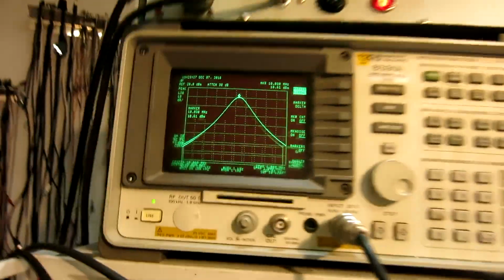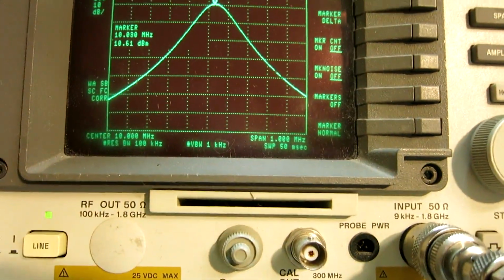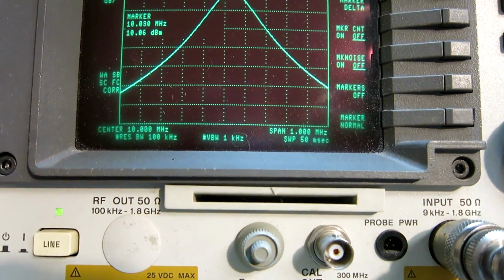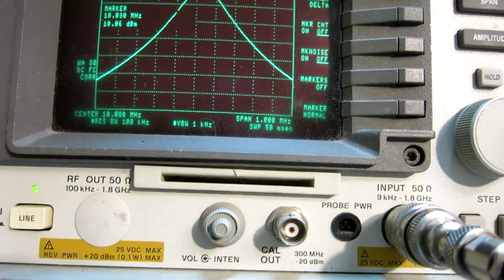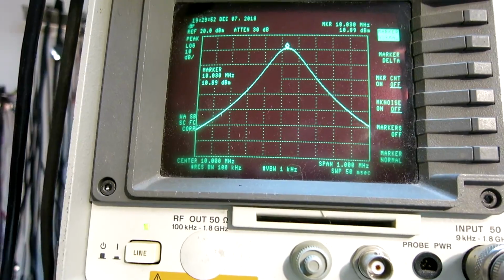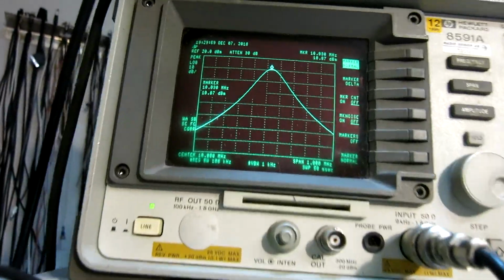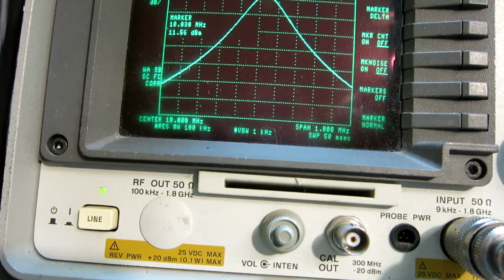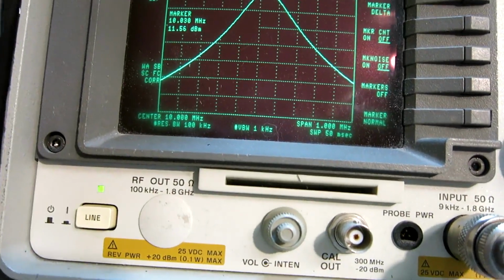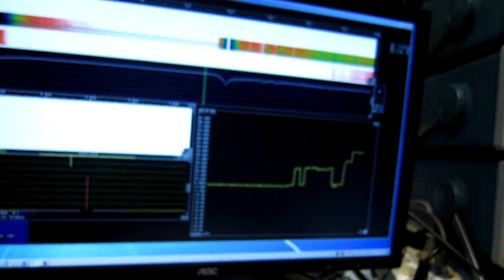And looking at the output and step 1 dB downwards, it makes no difference. And only half a dB for this 1 dB step. So I can increase the supply voltage, and that gives me more power. And then stepping up the signal generator to 15 dBm, it gives me now 31.5. But as you can see, noise is very high.